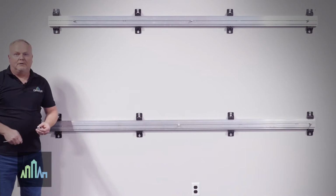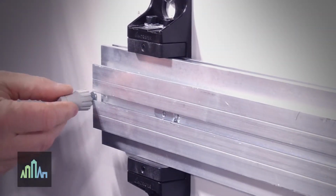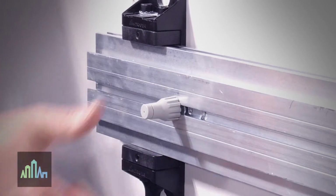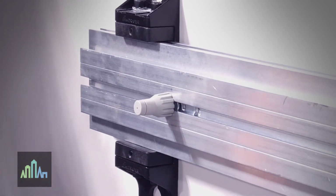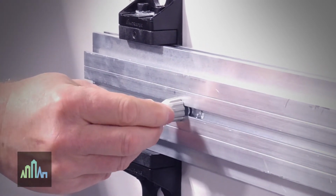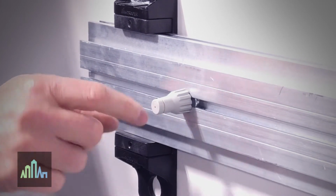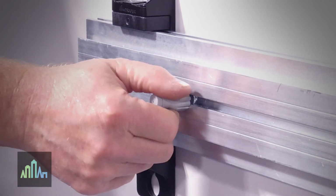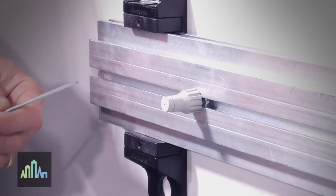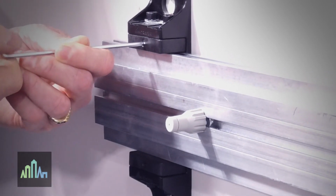Draper also supplies you a plumb alignment pin. As you have these alignment pins in place, and you want to use several, but certainly have some near the wall bracket, you're going to shoot your laser at this level, and then you're going to use your pin, your Allen wrench again, to do the adjustments to each wall bracket to make sure those are aligned with the laser light.